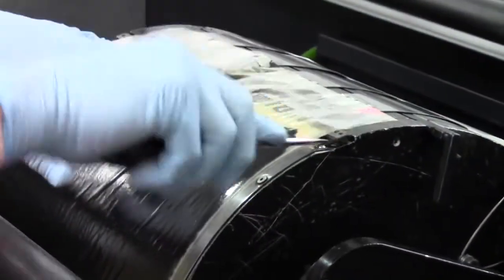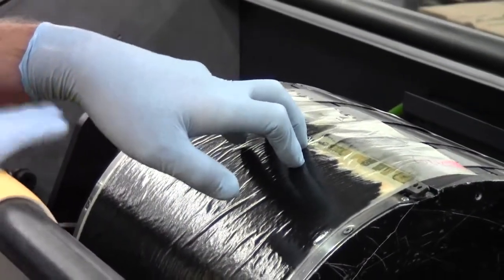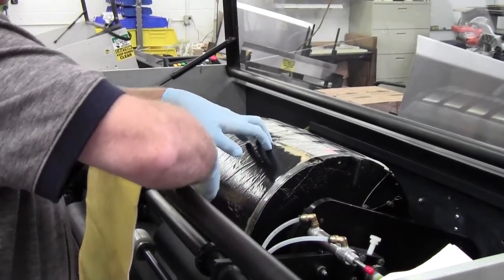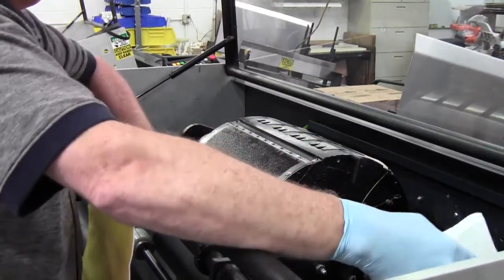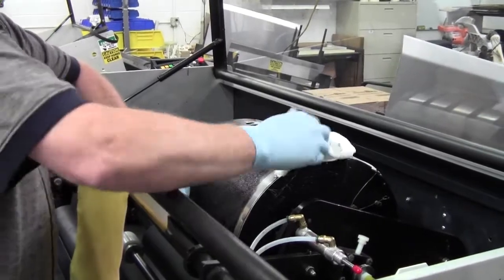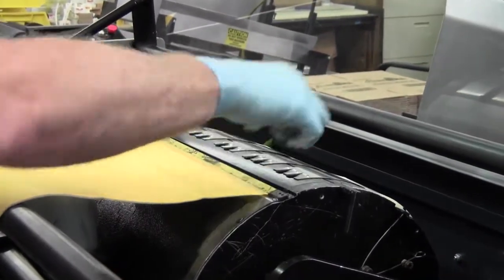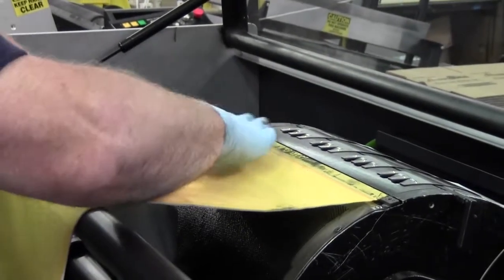Release the stencil and release the bar. It's important never to let go of the pad that's on the print cylinder, otherwise it will leak out of the underside. I put the bar into the new pad and I start rolling up the old pad. This is the only time that you will have to do any kind of clean up, so it's important to get that right away. I set the new pad in place and center it.